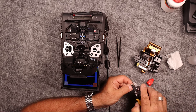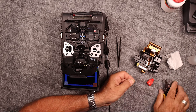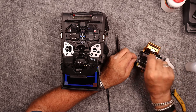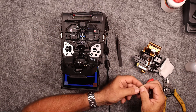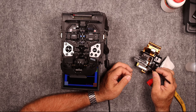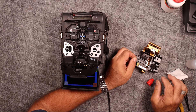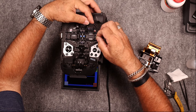We're going to do a sample splice here to see what kind of splice performance we're going to get. Going back to our standard stripping methodology — strip it back, cleave it out to about 10 millimeters. Some folks like 8 millimeters, some like 12 — as long as you're within the realm of acceptable lengths on your machine, you're fine. The reason I use 10 is there's a line right here at this pad that is the 10 millimeter mark. So I line my plastic coating right up to the edge there — it's just a good visual, easy to see in good light and low light situations.